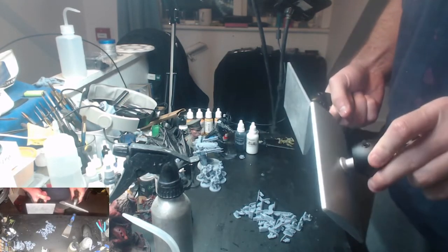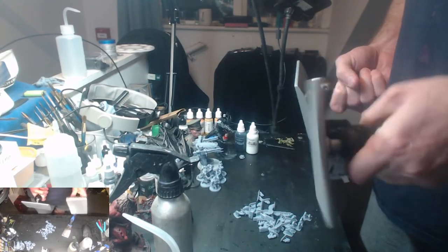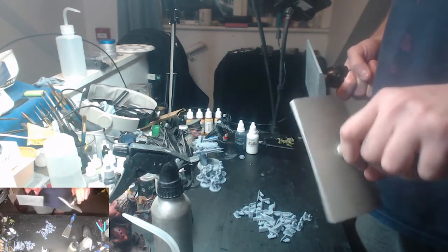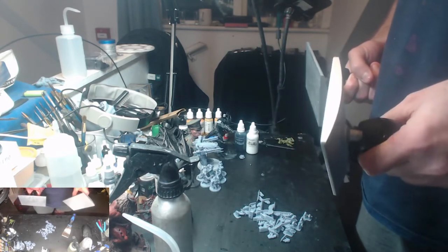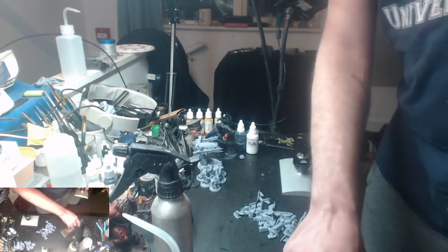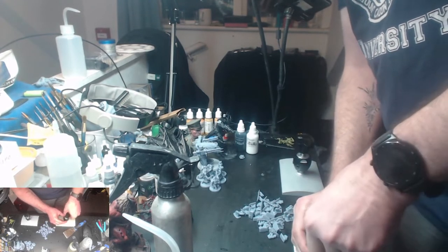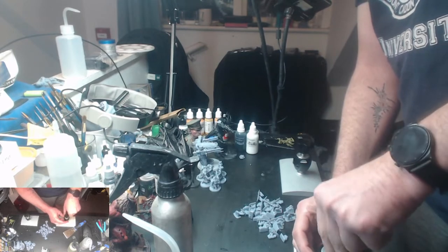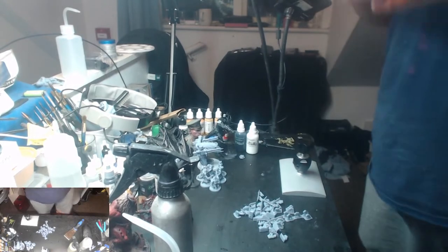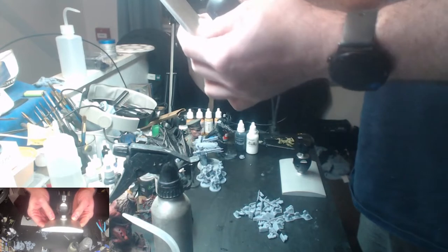And it has nothing to do with, oh, tighten the screws. The screws are tightened. The ball on this print bed is so small that the set screws don't set it. Ever. So even if I tighten this thing all the way up, that is not straight. That is cockeyed.